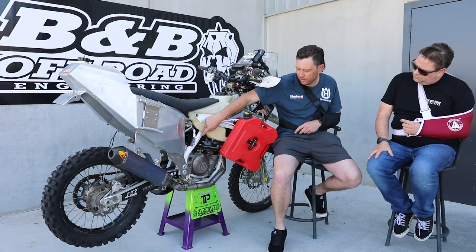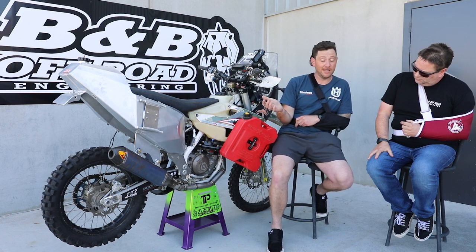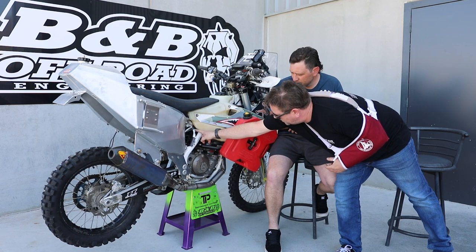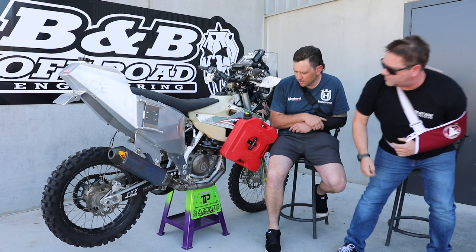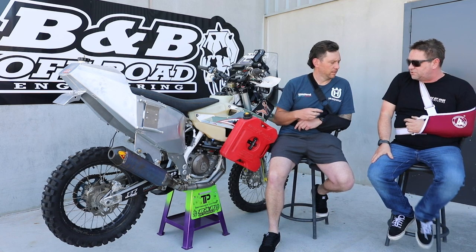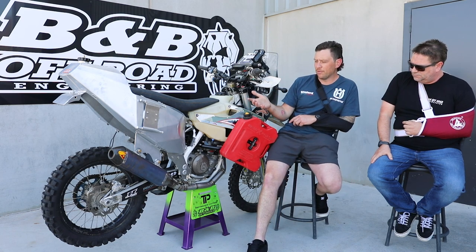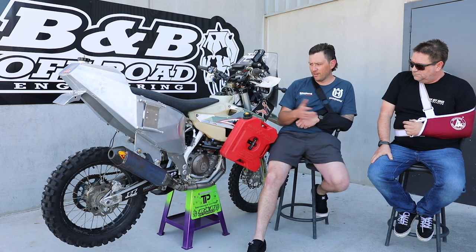There are a few things on the frame I'm going to be doing just to stiffen the frame up, because there were some cracks in the frame when you pulled it apart — just came from the desert. There's still Simpson Desert in the bike so you picked up a few cracks already. This was cracked through here. Under load this actually straightens and flexes the frame here — it was nearly all the way around, so that needs a little bit of attention and probably some preventative fish plating on the other side as well. When we get this home we're going to strip the bike down and do a bit more repairs. This isn't the final configuration of the bike but it's really cool to see it in its raw form.